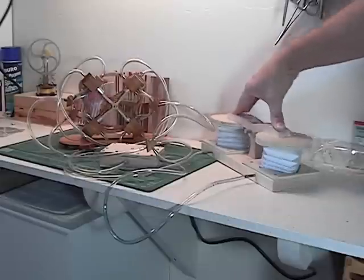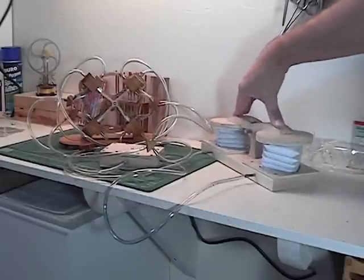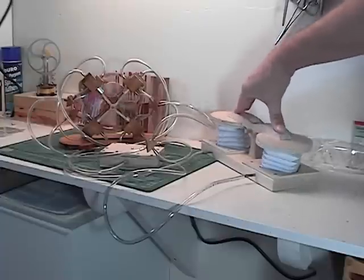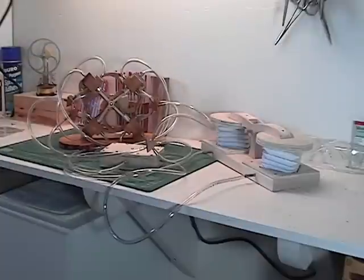There's been a request to show it using power sources other than the bellows, so I'll see what I can put together. Since I don't have an air compressor, I'm going to use a shop vac. Since shop vacs use a continuous flow of air, we're going to disconnect that and directly drive a unit with the shop vac. It'll just be using vacuum, so I'll only be feeding half the system — it will work on vacuum but not pressure at the same time, but that's what I have available.